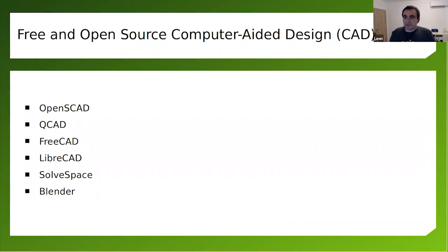So the hard part for me actually is not designing the printed circuit boards. It's rather designing a decent case for it. Laser cutting, 3D printing, whatever is your favorite tool and approach, you need something to design the case. And sometimes for low volume manufacturing, designing the case could be really tricky, because you have to keep the price of the case relatively low, and you still need a manufacturing process that's easy enough. And injection molding is never an option for a small scale project, because the initial investment is really big.